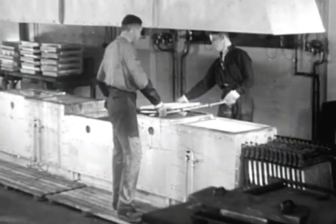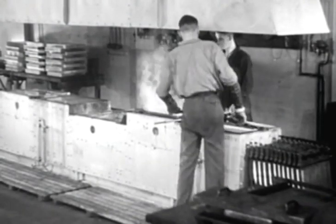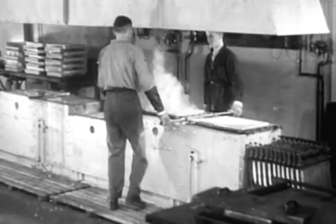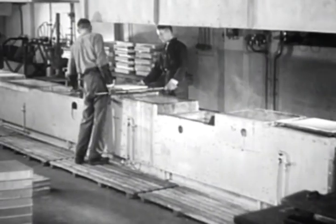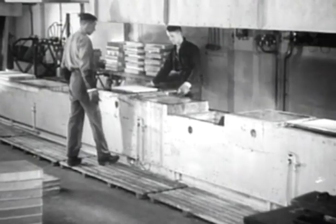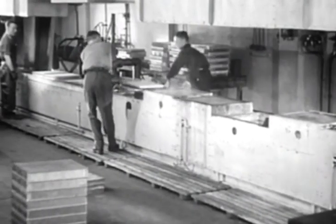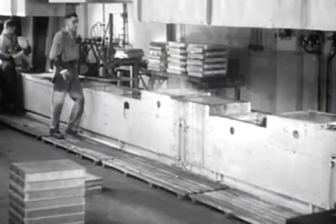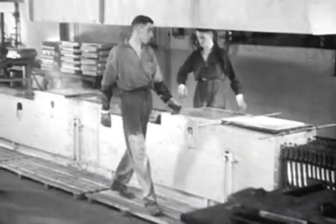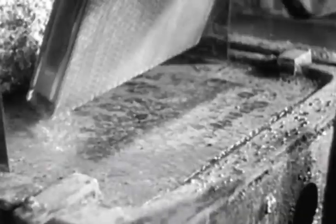The assembled block is being soldered, dipped first into the flux and then into the solder bath, most carefully. Here we see the stately dance of the tinsmiths. First one side and then the other is sealed, and the solder hardens as the block is held firm under the press. So this unvarying ritual goes on with barely a pause. Now the ends are soldered so as to complete a rigid block built up from over 100 yards of strip.